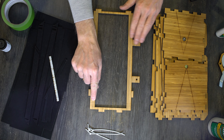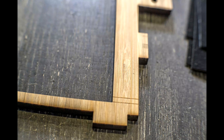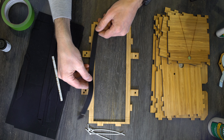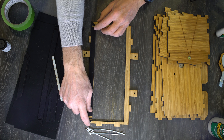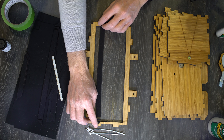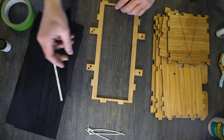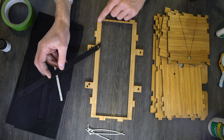The next part has lines etched on one side — four lines represent the top of the camera. The felt gasket is going to go here, lined up with those lines. The overall length of the wool gasket matches the overall length of this piece because of how the geometry fits together. This geometry was the hardest thing to design. The long pieces go with the two cutouts going where the four lines are, and the single cutout going where the single line is. Those lines represent the light seals for the 4×10 and 4×5 cameras.